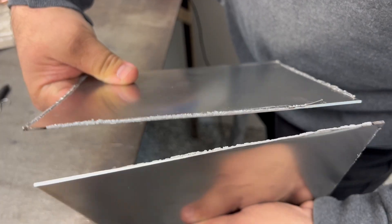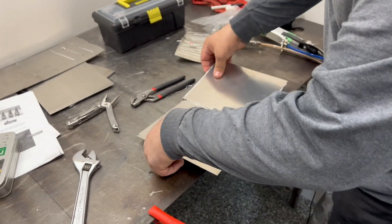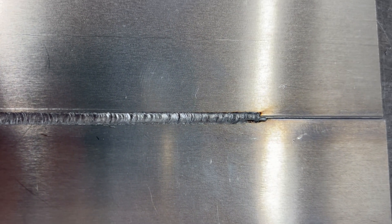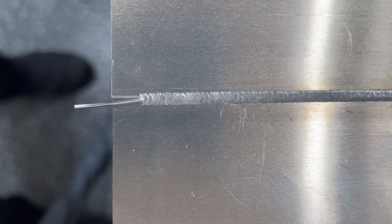When you break it, this is about 30% penetration right there. It even bended a little bit pulling it apart — I could have moved a little bit slower. On this next one I dialed the settings up just a little bit, and you can see I'm still having problems with that wire sticking out at the end. This one has a little bit of bleed-through. Even though on a TIG weld this would be considered a full weld, here it is not really a full weld — this is about a 50 to 70% weld. So looks are really deceiving with laser welding.